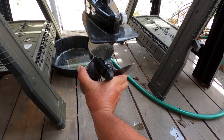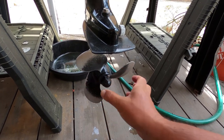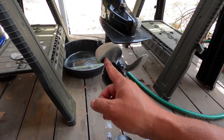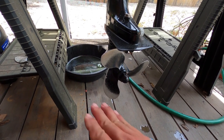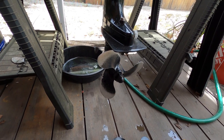That's because that rubber is giving way and it is toast. So basically as you put torque to this in the water, this will end up getting to a point and then start free spinning, and that's where you lose power or you lose propulsion. So that's how you know that hub is gone and it needs to be swapped out.